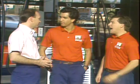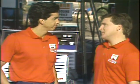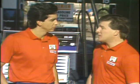Can't we just turn the pump switch off at the cash register? No, absolutely not. That switch only shuts down the hoses, not the submerged pumps. The danger would still be there. You have to shut down the submerged pumps. Okay. Now, once the pumps are shut down, you call the fire department, and then you call the manager right away to let him or her know just exactly what's happened.